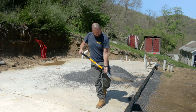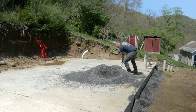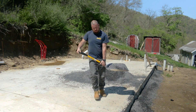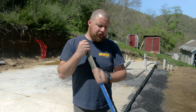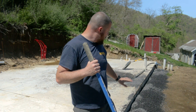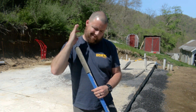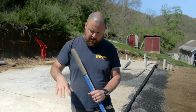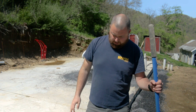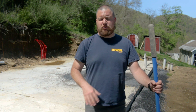We're going to rake this stone out so we are pitched down. I'm not going for anything specific, just enough pitch where water is going to run off that XPS foam board. We have about eight inches from the bottom to the top here, so we're going to start at eight inches and just fan it out to about nothing.